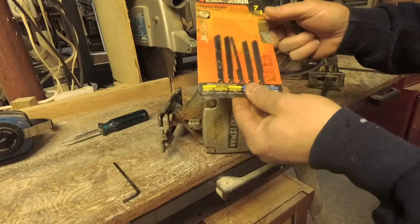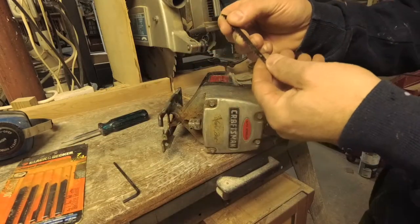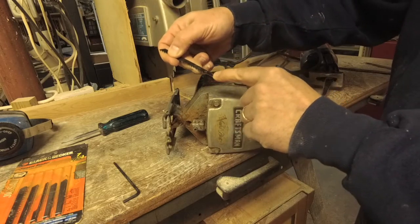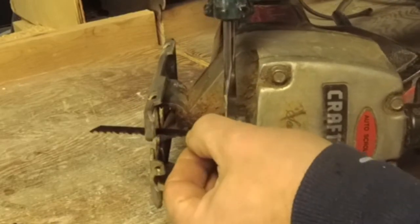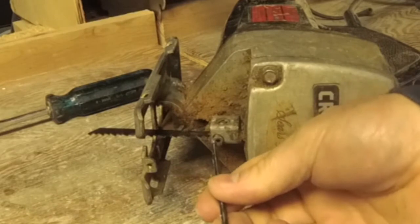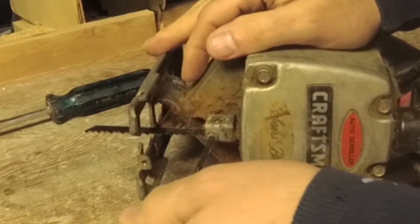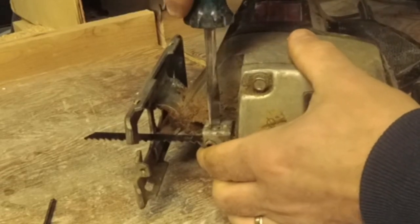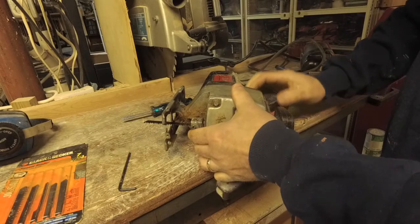So you have some options. If you have one of these scroll saws for doing several different things, they do a lot of fun stuff. In this case, this blade is fine, so I'm going to put it back in. To do that, it's pretty much a reverse of the same process. The key thing is to make sure that screw catches that hole in the blade so it doesn't come out when you're using the saw. Get it in there and get your screw started until you know you've caught that hole. Once you've caught it — you're not tight yet but you've caught the hole so it can't come out — go ahead and tighten the set screw on the front, which will push the blade back into position and make sure it stays straight. You can actually see it straighten out a little bit when I tighten this up. You don't want to reef down on this, but you do want to make it good and snug. Then you can go back and tighten the blade right down to make sure it's not going to go anywhere, and this thing is good to go.